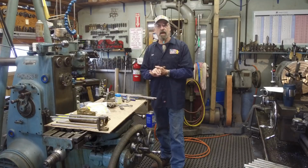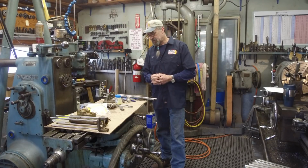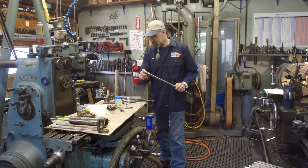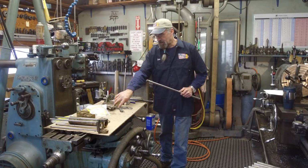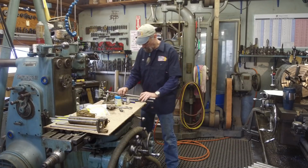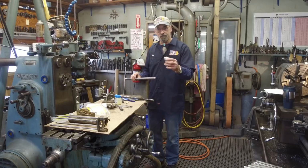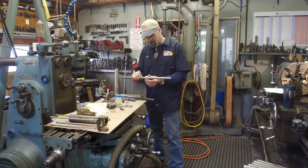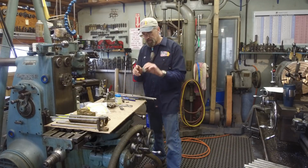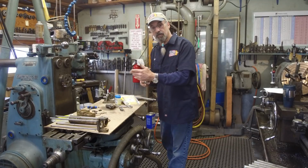Regardless, we're putting back our hydraulic cylinder, and we're still working on our temporary flat spot here. And you saw we've already put the threads on here, so we have the end and our nut works on there. We set it up and we centered our first hole, and now we need to go ahead and put our piston on here and locate that hole and put the spring pin in there. But we first have to, here's our other wipers and our other O-rings that we didn't have in stock.